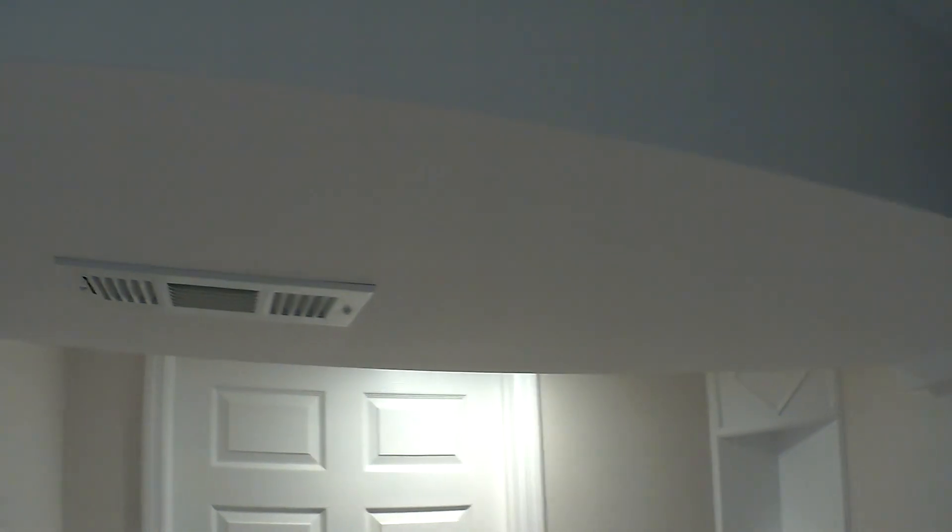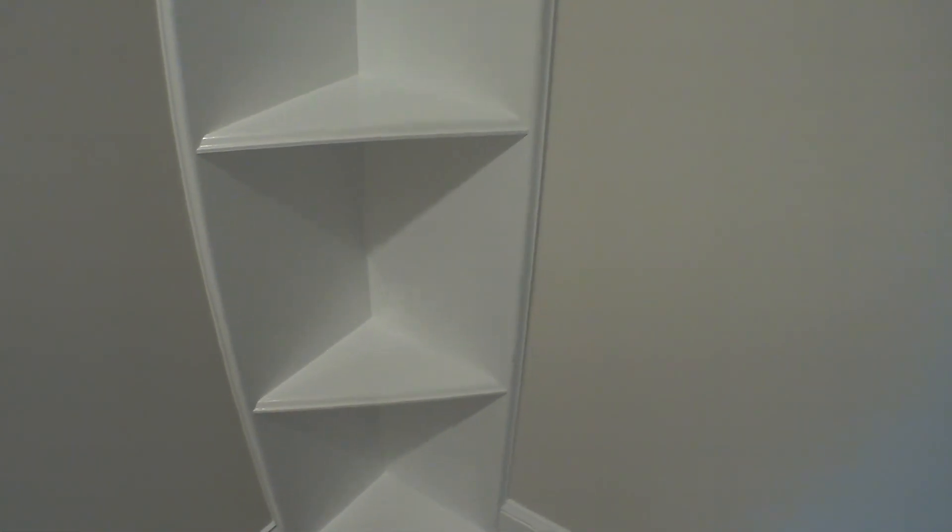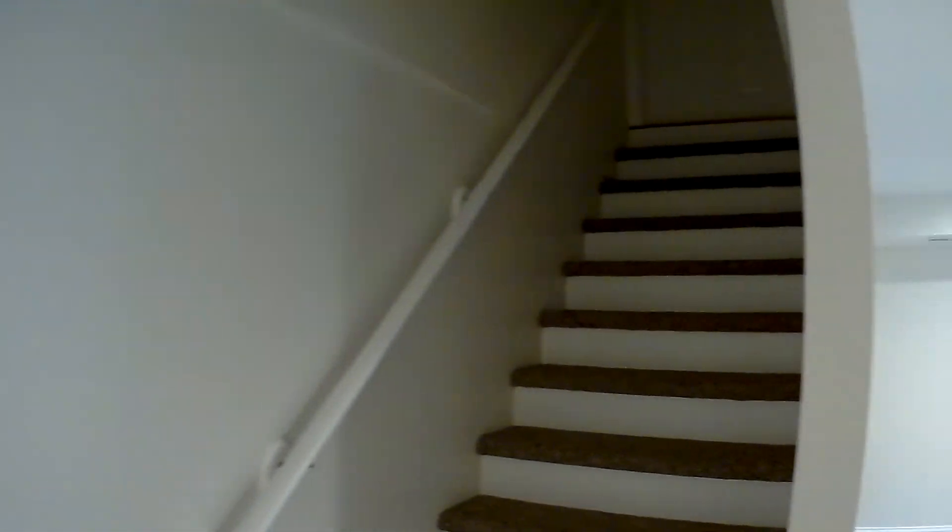These were just regular basement steps and I had these plaster walls, but then I put up new walls to cover the lally columns. That ductwork there is all covered with plywood and exterior plywood and green board, so you don't have to worry about mold. If anybody's planning on covering ductwork, do that so you don't have issues down the line. This little shelf right here — this was another piece of ductwork that went by, so instead of having just a little bump-out, I put a shelf so she could put knickknacks or whatever.